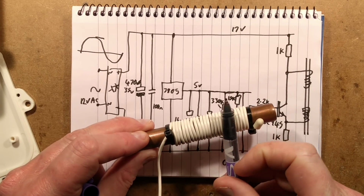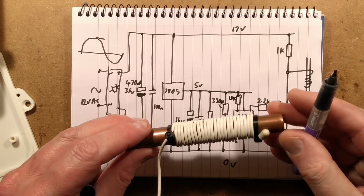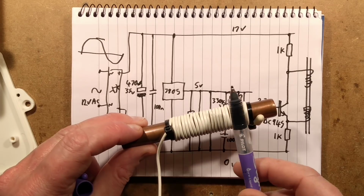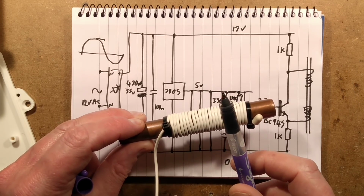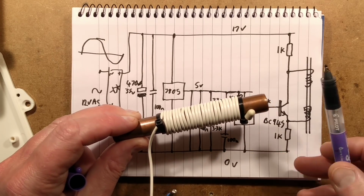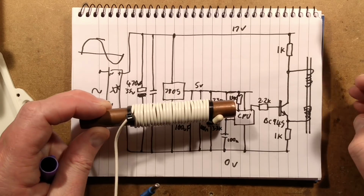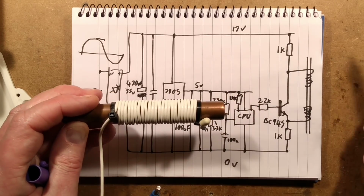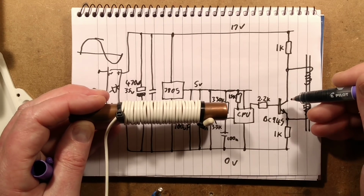You're going to have a capacitive element to the metal or to the liquid inside. If this was on a plastic pipe, you could theoretically, by having these and having an AC signal across them, couple some current into conductive water, and hard water tends to be fairly conductive. And by having two of them on the plastic pipe, you would then theoretically be coupling a bit of current through the water, but it's tiny.